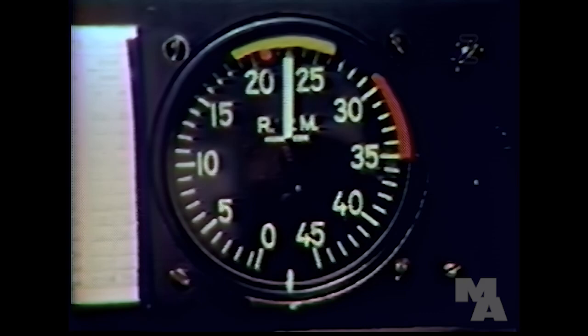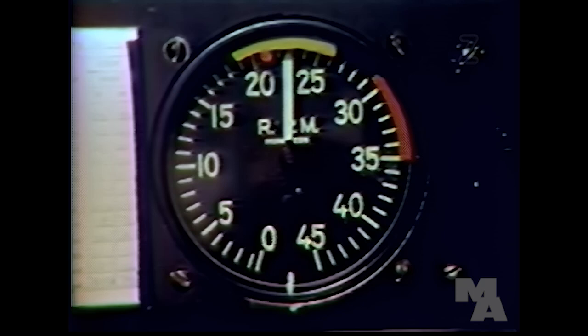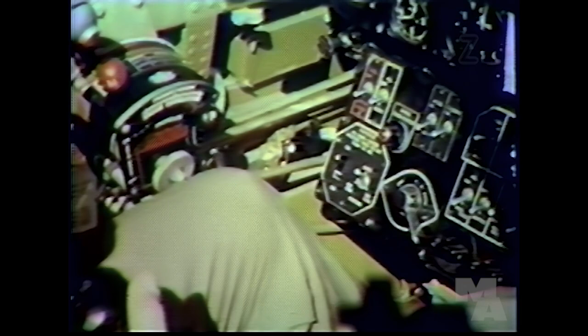With the propeller switch on manual, run the engine up to 2300 RPM and check the magnetos. A drop of more than 100 RPM on a single magneto indicates faulty ignition. If the magnetos are okay, then switch the propeller back to automatic. Release the parking brake and taxi to the runway. The tail wheel is steerable by the rudder pedals, so don't ride the brakes when you taxi.